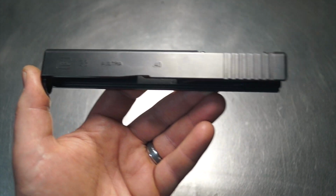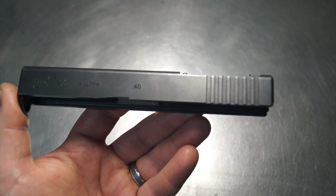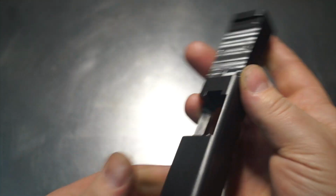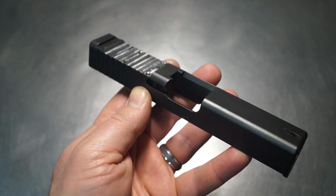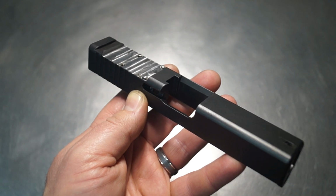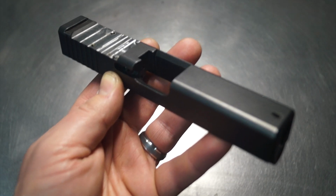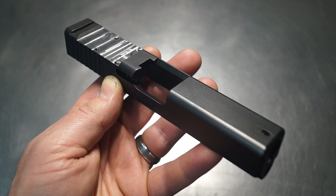So guys, what we're going to do now is we are going to start on the Tormach. We're going to go ahead and get the top window done, the shaved sides, the step down, the window. Then we're going to navigate over to the laser system. We're going to go ahead and get that logo put on there. What's going to happen on my end at that point is everything is basically sandblasted, looked over. If it needs to be hand lapped, everything will end up getting hand lapped and sanded down, sandblasted again if it's needed. Then we'll go right straight to the ultrasonic cleaner. We'll do a cleanup, we'll do a color, we'll do a reassemble. So that's kind of the process on my end from once we stop the footage.